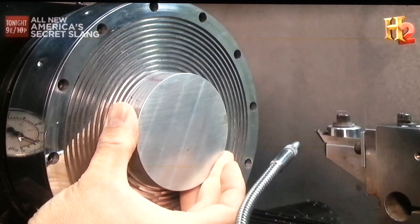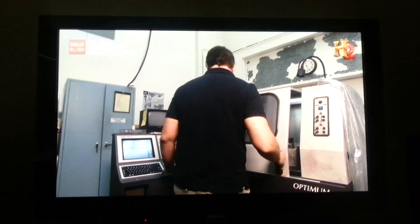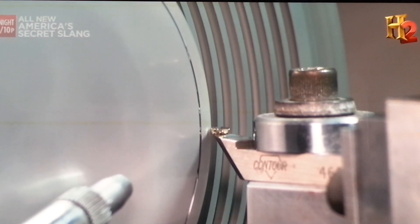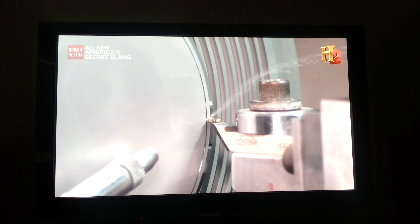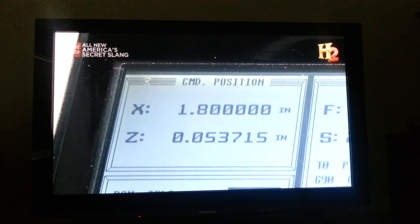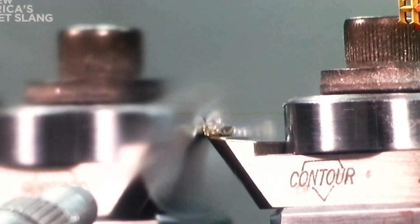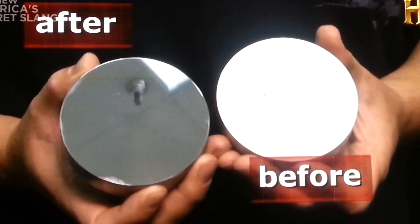The challenge for NASA's engineers is to turn pure aluminum disks into mirrors. Pulling that off requires getting rid of the rough surface — a diamond-tipped lathe is the answer. It digs in just below the surface and in a uniform slice begins to smooth the aluminum to a natural shine. During the procedure, a paint thinner solution sprays away debris and cools the diamond tip, which heats up as it carves into the metal. After just two minutes, a final polishing treatment smooths out leftover microscopic imperfections.